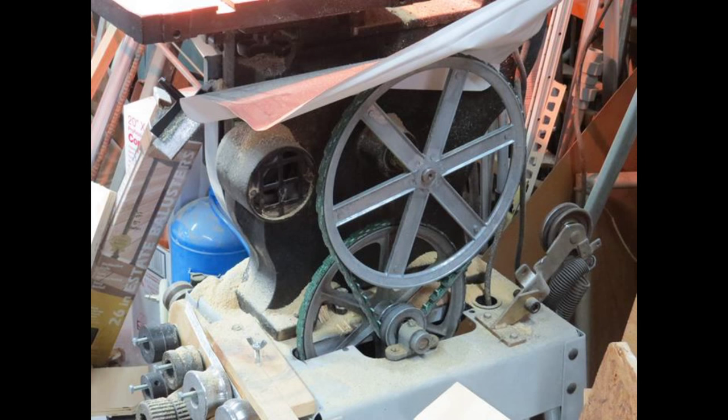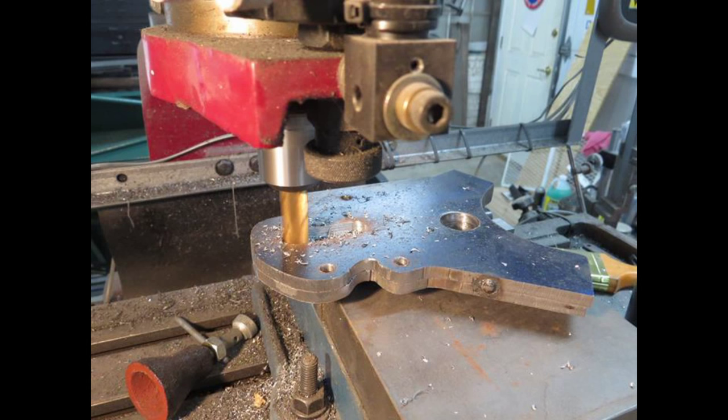Here's the pulley system I rigged up — it's got a jack shaft with an intermediate pulley. When you do all the math, it comes down to 100 times speed reduction, and that's exactly what you need to cut metal. It's not too fast and not too slow. When I went to cut the holes in the rear axle plates, I welded the plates together with a couple of spot welds so that during the drilling and milling operations everything was perfectly aligned. By spot welding them together, I was also able to do final finish sanding and grinding so they are a perfect match. Here I'm in the milling machine with an end mill coming down.